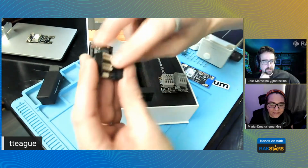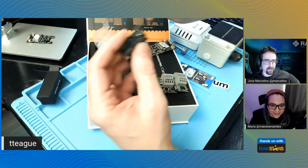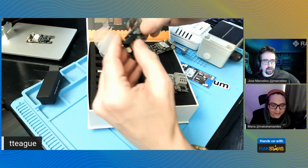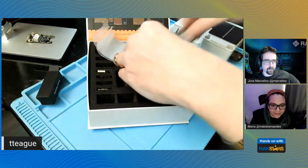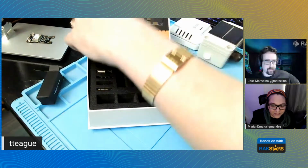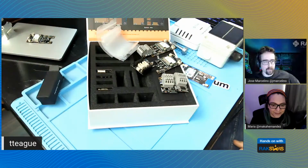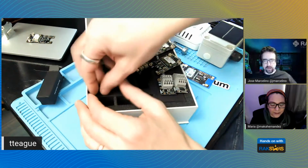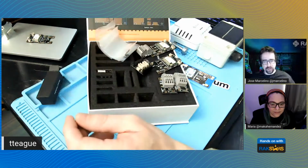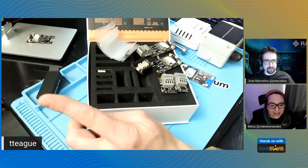And so you have 3 different formats that you can connect very easily to the I/O breakout, just on the end of this board. You say, okay, the sensor doesn't come, it's not one of these sensors. There's hundreds and hundreds that you can just plug right in there. And they can be 5-volt sensors as well, because there's a boost circuit on that board. So they can be 3 volts or 5-volt sensors.